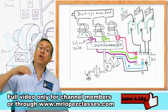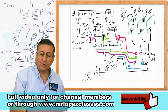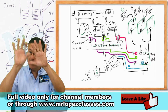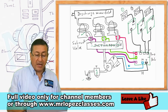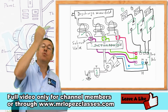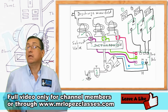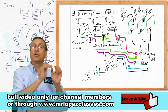When I want to start the second air conditioning unit, I select the desired temperature on the thermostat. Immediately, that thermostat sends a signal to the board of that equipment, and the board sends a signal to the pump relay. The pump relay activates the pump and activates the solenoid valve, supplying water to the second or third unit. All three units can work at the same time because the pump has the capacity to supply water for all three compressors.